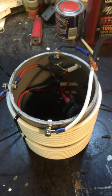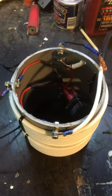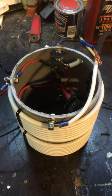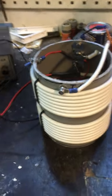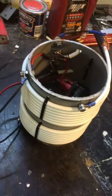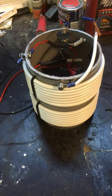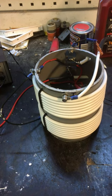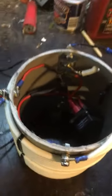Welcome at PapaEcho for Bravo Alpha Sierra. What I'm showing here is a balun with a ratio of 1:4 and 1:1, switchable. It's a balun or impedance transformer — I use it as an impedance transformer, at least that is what it's designed for. I wanted to try to fit it between my vertical and the automatic antenna tuner, so it's just an experiment and this is a prototype.